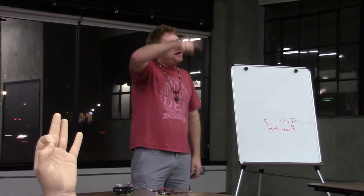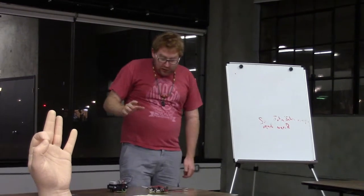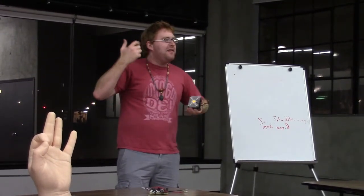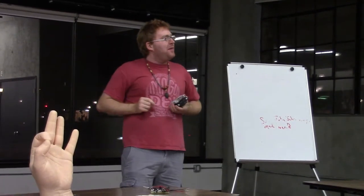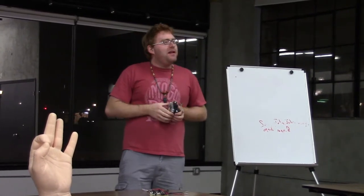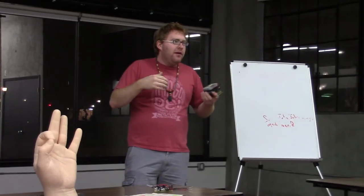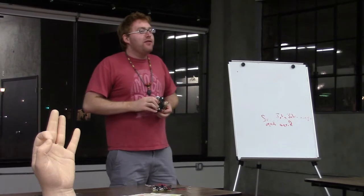When you're turning it on and off, you get these little plateaus of current, and then they shut off. So actually, the LEDs are always running at full brightness. It's just your eye isn't fast enough to keep up with the switching. Your eye says, hey, that's not emitting as much light, which it isn't. But for the time periods that it is on, it is emitting as much light as it normally would. It's just not on as much, and your eye is too slow to keep up.